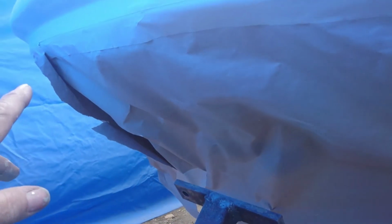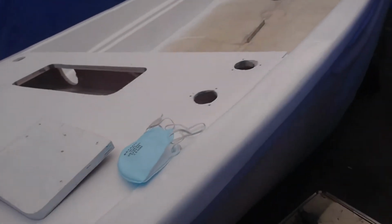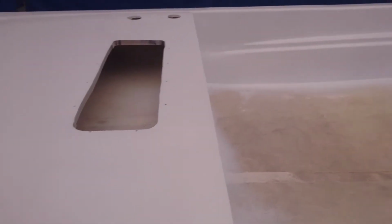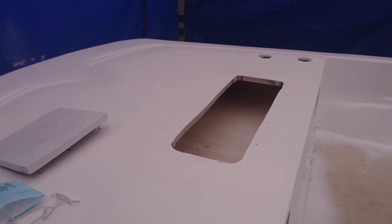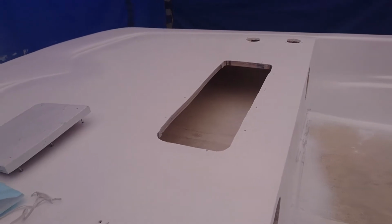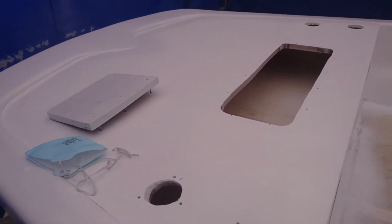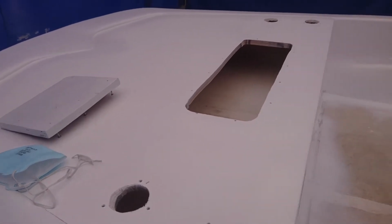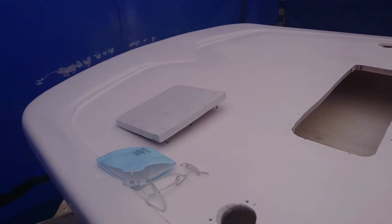So I'd already ordered an M10 bolt, and it turns out for the cleat that I've got, or bought, that I wanted, it was an M12. So I reordered again some more, another rod of M12, and an M12 lifting eye, rated at 340 kilos. So I'm pretty sure, because it's not lifting it and it's only pulling it onto a trailer, that should be more than adequate.